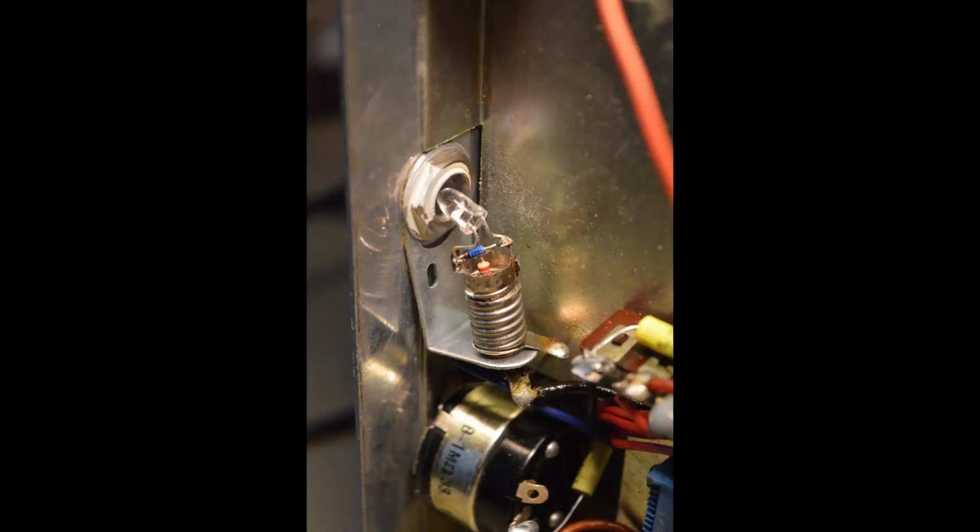When I got the instrument, I found that the filament voltage on the tubes was too low, below 5 volts. And it turned out that somebody had replaced the pilot lamp with one which was too powerful. So that dragged the voltage down. So I decided to replace it with an LED. I was inspired by a video from Electronics Old and New by M Caldeira. I will put a link below to it.